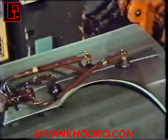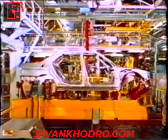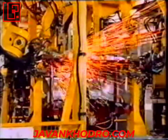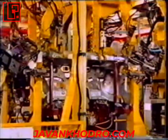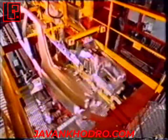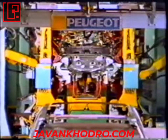For several years, developments of steel panels and the use of unitised bodies have resulted in the creation and use of new assembly solutions and welding processes. The use of thinner and higher performance HEL — high elastic limit — steel panels imposes a number of precautions during assembly. On the 605, 72 to 73% of panels are pre-protected by electro-zinc plating or galvanisation.